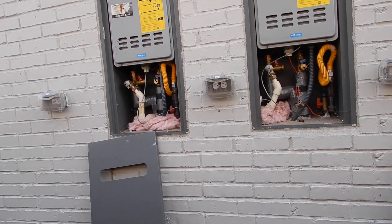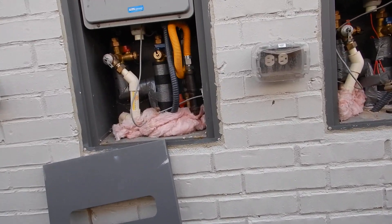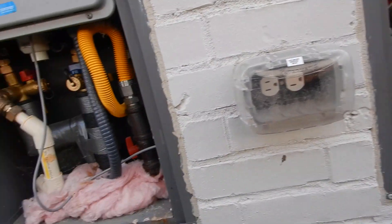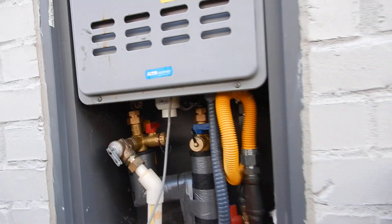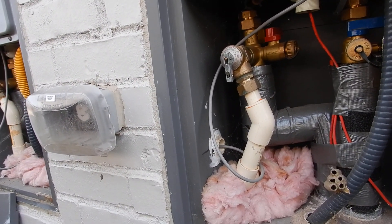You'll get the performance that you paid for. It's part of the house — it's part of the whole deal. These are supposed to be serviced once a year. These TPR valves are supposed to be replaced every three years, so it's about time. That's not really going to affect the age of the unit unless it refuses to open and blows the whole thing up — of course that would affect the age. So there are reasons for that.